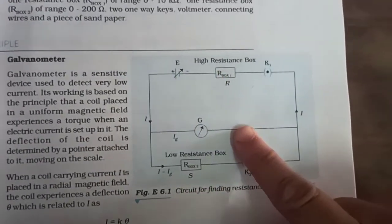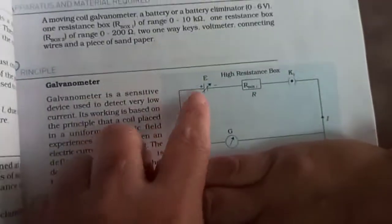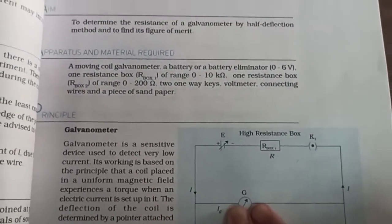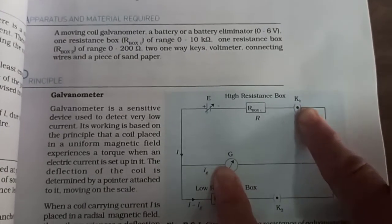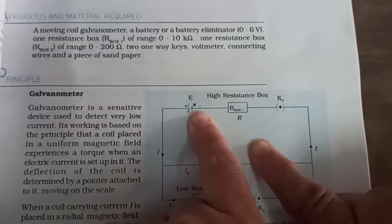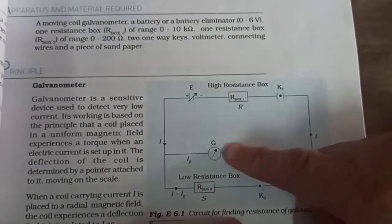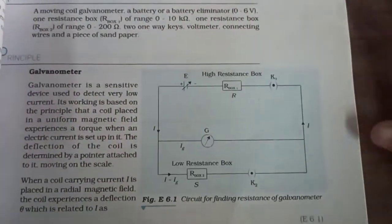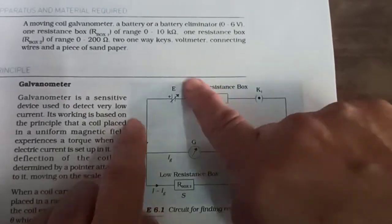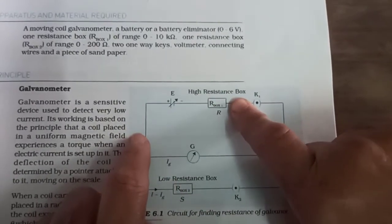Now see how to connect this circuit. Start from the positive terminal of the battery. The positive terminal of the battery is connected with the galvanometer. Another end of galvanometer is connected with key, and the second terminal of key is connected with resistance box. Resistance box is connected with the negative terminal of battery. Resistance box, key, or galvanometer have no polarity, so you do not have to remember which connection is with positive or negative. These four components are in series, so if you interchange the position of any one, it does not make any difference in your result.